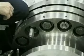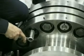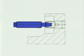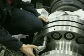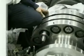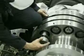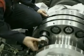The tapered adapter, which enables the tooling to be used, is then fitted into the tapered thread insert in the end of the bolt. Next, a mounting collar is fitted over the adapter. This centralises the sleeve in the bore. Finally, the tensioner is fitted to the end of the adapter.